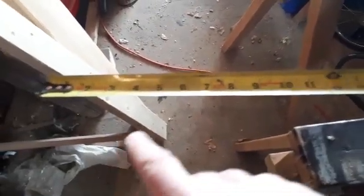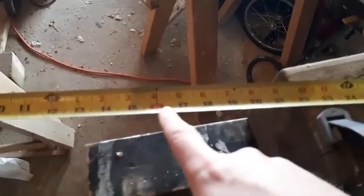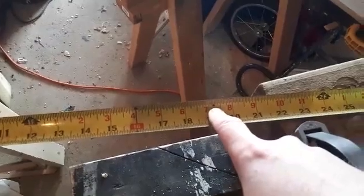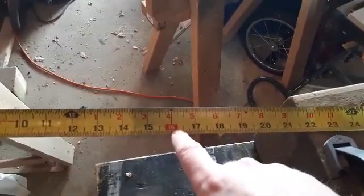Also, with the tape measure, you've got a handful of other little indicators. So, on a tape measure, you've got all sorts of extra markings. Obviously, you've got indications of the feet, but you also have these red, or they're not always red, sometimes they're other colors, and you've got these little diamonds up here. So, what the hell is all that? Well, the red markings are your 16 on center.